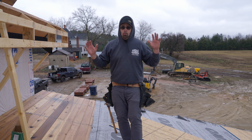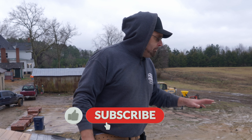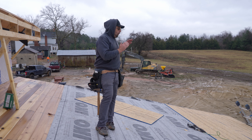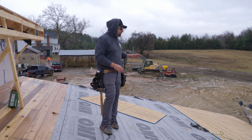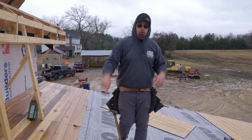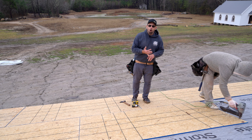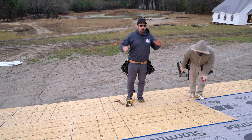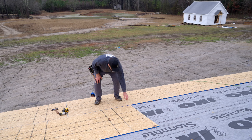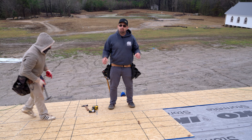It's a little slippery and wet for us to be trying to climb all over these beams. So what we're going to try to do today is get the plywood sheathing on this lower portion of the lean-to. We are only going to be able to tack the plywood with the staple gun on the four-foot centers so that the staples will not penetrate and go through the tongue-and-groove roofing. We're going to place eighth-inch spacers in between the plywood so it creates that separation.